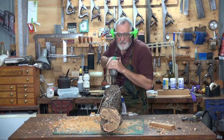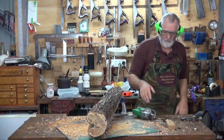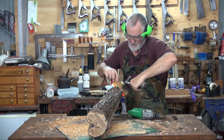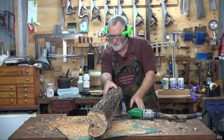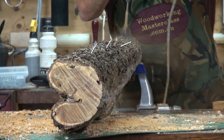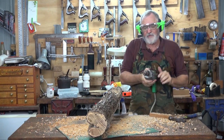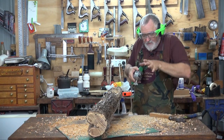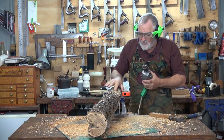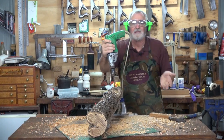But it'll be worth it. Once you get a flat surface, the spade cutter is cutting all the way around, so then you can turn it or lean it back a bit. If only half your spade is cutting when you turn it, it'll jump, come out of your hands — it can break your thumb, break the drill, break the bit. There are all sorts of horrible things.